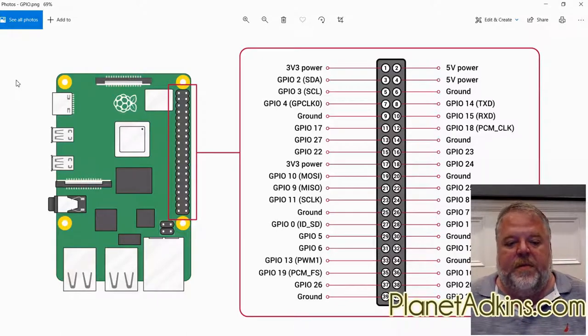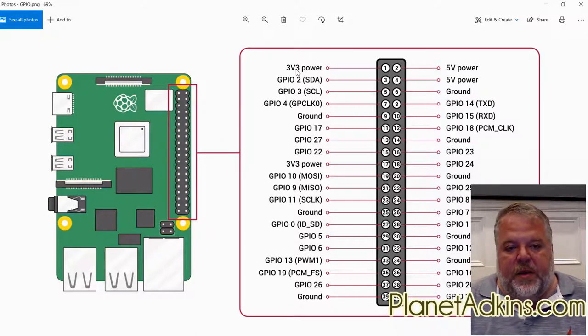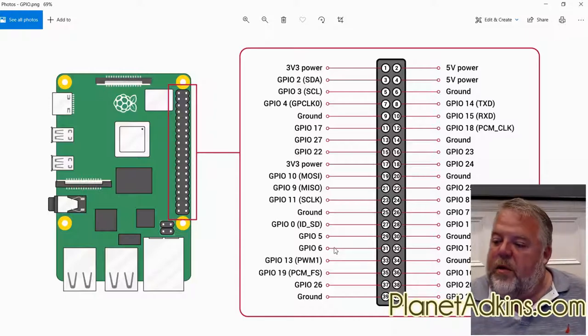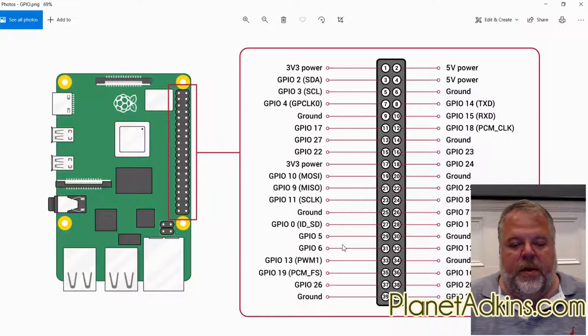So how do we use the pins on the Raspberry Pi? It's very simple. The Raspberry Pi has 40 pins on a header. In this particular case we're going to use the 3.3-volt power, ground, GPIO 5, and GPIO 6 as indicated. You need Dupont wires from pins 5 and 6 and from the 3.3V and ground to the relay board.